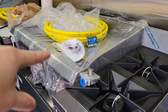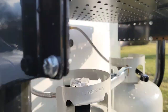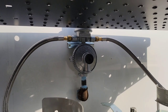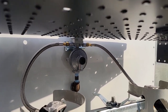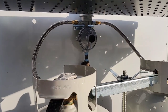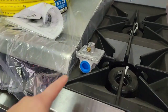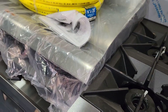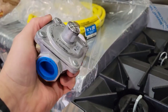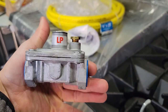The 36-inch griddle, 12-inch burner, and fryer all run off this propane changeover regulator. Since we have the changeover regulator up front, we bypass the individual regulator that comes with each piece of equipment — you typically would have run a propane tank straight to that and then to your equipment. But since we're bypassing it up front, I just use the one regulator in the front that feeds all the equipment.